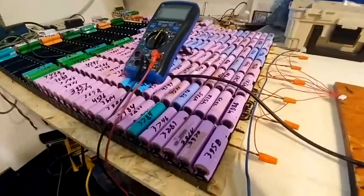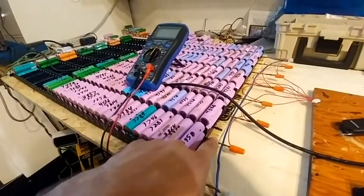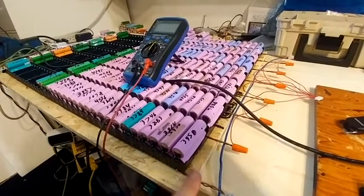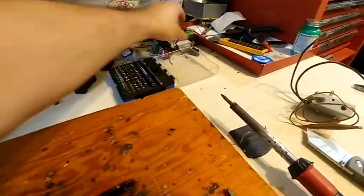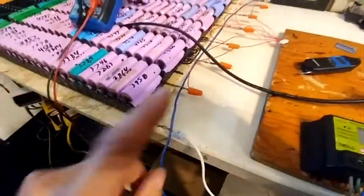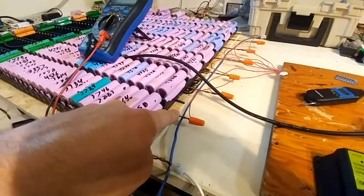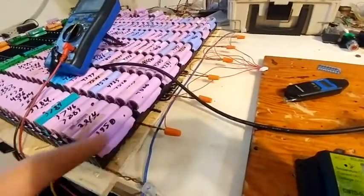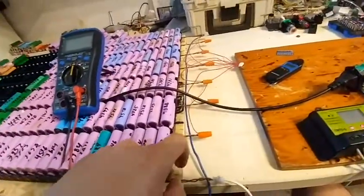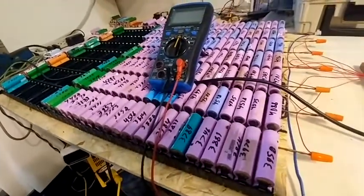My next thing to do is drain the batteries fully, take them all off, then flip this bracket upside down, put liquid tape on the underside of all these connections, put electrical tape over that, then put the drywall down, then put this thing down, then screw it down with these little screws. That should be an almost fully done power wall. These will get big blocky connectors, and these leads will all get chopped off — it's a little dangerous to have them sticking out. I'll have terminal bolts on each side so I can connect stuff up to it, and maybe even a soldering joint.